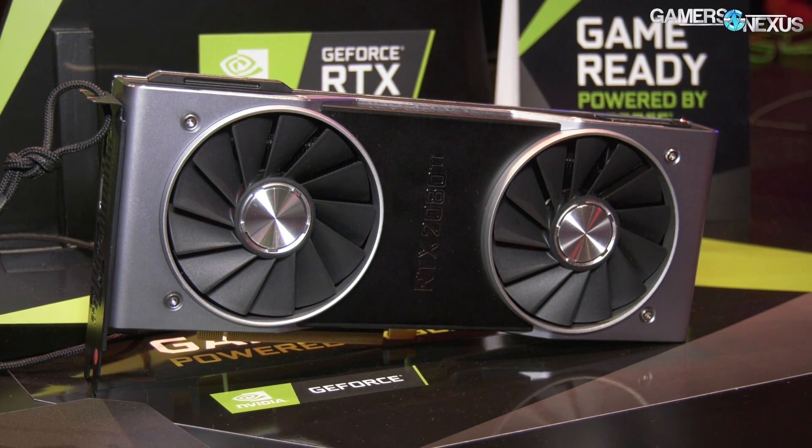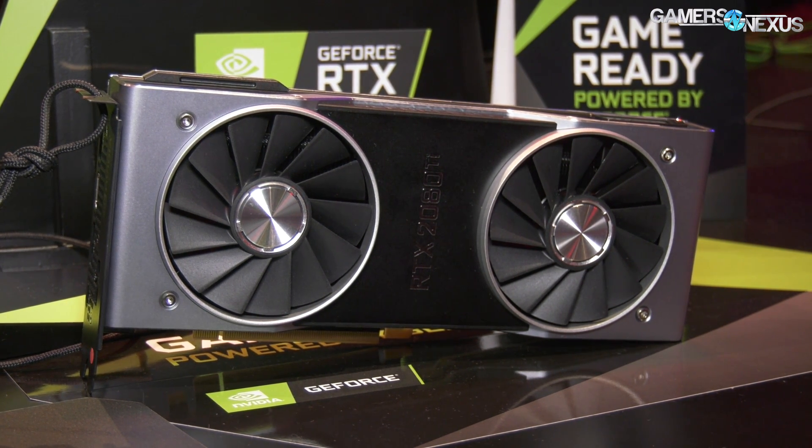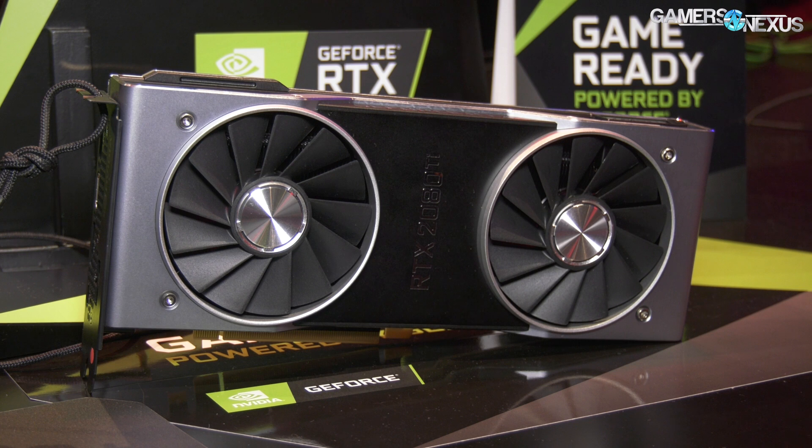The truth is, we know exactly how our silicon behaves. We set our peak voltage limit to be reliable so that we can run at that voltage for many years — five years is typical. As you increase the voltage beyond that, we're going to start having fallout, meaning some chips are just going to die. It's our obligation to help gamers not blow up their cards. Everything else on that UI for overclocking is non-destructive and doesn't void warranties. We don't track if you over-voltage or not.